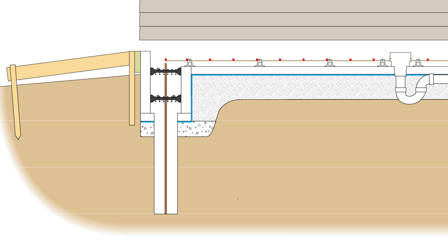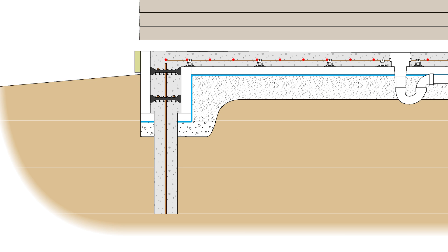Then we get to the pour. Place the concrete — this is the only part I hired out. The monolithic pour will flow down, creating pilings to prevent corners from heaving and sinking. Let it cure and cut control joints. Remove the kickers, then remove the form board to reuse as a sill — attach with wedge anchors. Place a foam sill gasket beneath the sill. While not required, add underground horizontal wing insulation, and finally a cement board for protection of the foam and flashing.